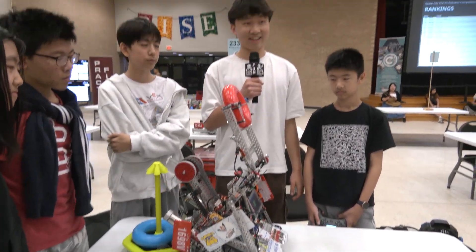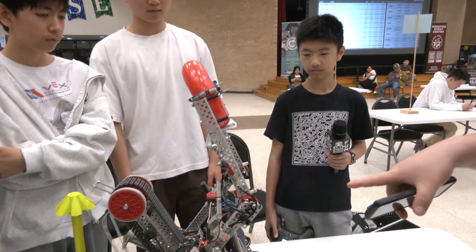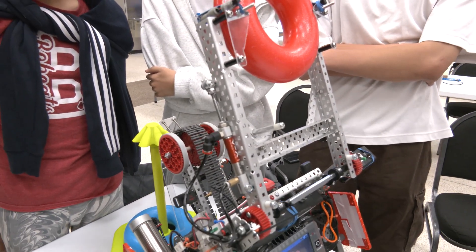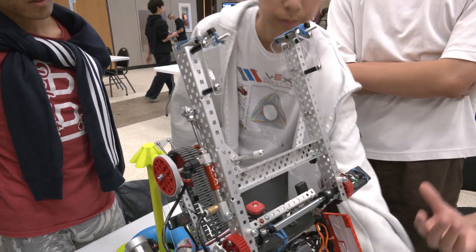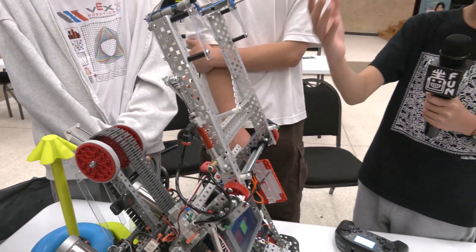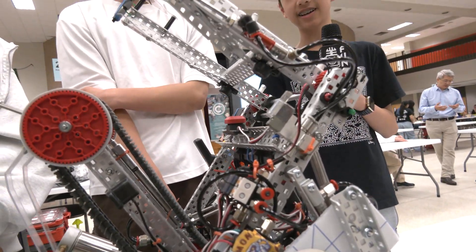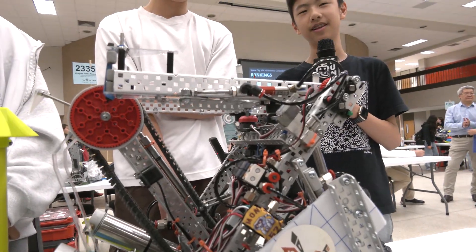Zishman, I see you've got that reset bumper going on there — and what is this little device here? So that little device we call the clip. What it does is it keeps the ring from falling out from behind, because when it's out and we get hit, it could fall, and we don't want that. It also helps because we don't have to put mesh here, making it easier for the ring to go into the Lady Brown. The reset makes the arm go to this position every single time — if I reset, it goes back to that exact position.